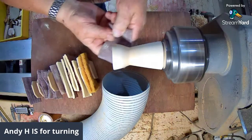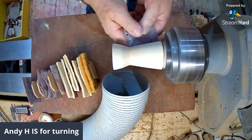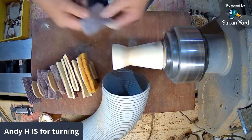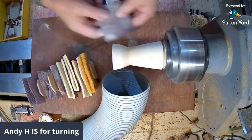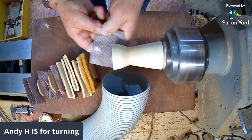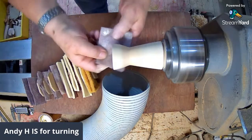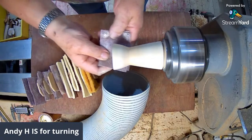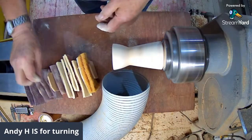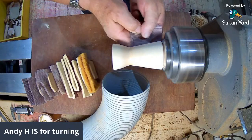This one's a lot better finished than the other one, simply because it hasn't got all the awkward bits of grain. Does make a lot of difference on yew. You know, I haven't bothered with 80 grit at all. I had to on the other one, which is probably why I went through and took the top off it, or nearly. Whipping through them fairly fast, but I should have a quick look, see if I need to drop back a bit more.